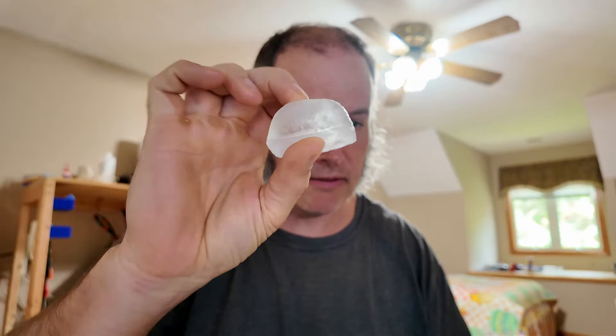With injection molding you have lots of design guidelines that you need to follow. For example, every plastic part has to have a very uniform wall thickness. You also need to add draft angles so that the plastic parts will come out of the mold. You can think of this like a bucket for a sandcastle — it's going to have a slant and not just perfectly square corners. Another example is an ice cube tray: ice cubes have a draft angle, meaning the edges are not perfectly square. If you had an actual perfect cube, it would be much harder to get it out of the tray. The same is true with plastic molds, but the draft angles are going to be a lot less — so small, in fact, that you will often not even notice them.